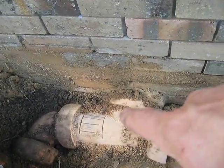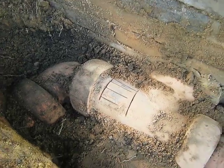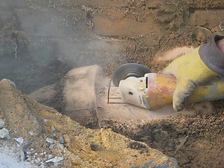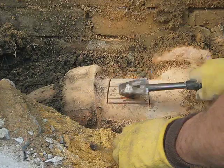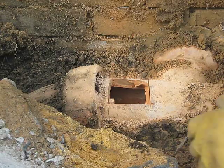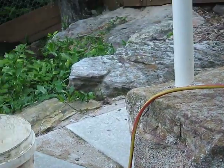Because I know this is blocked from under the house, I'm just going to make a little inspection hole here that I can later cover up if I'm able to unblock anything. There's been a bit of a discovery with this job. You can see there were a lot of roots growing in that area, going up into the pipe and blocking the pipe under the house. The drainage system going out of the house and down the yard is actually fairly clear.